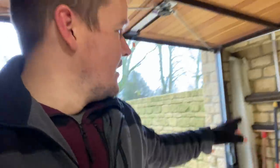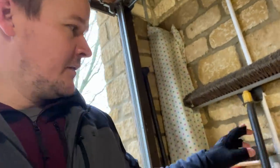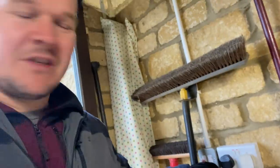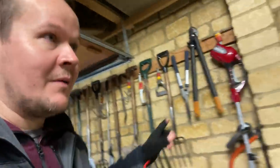Here's the garage, and here's one of the lights they've sent me - I've got it on charge so we'll have a look in a minute. This is a typical new build - we've got a 2.5mm incomer coming into a switch spur, literally just a socket and a light. We're limited to 13 amps. The light is fused down - probably a 3 amp fuse in there. We've got to add a switch over here for two-way lighting, and we've got two strip lights in here.